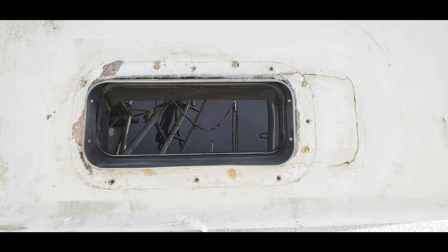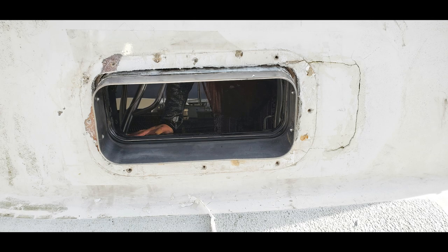Based on the pictures taken from outside, it looks good — it's sitting in the cutout the way we want it. We're going to start locating these holes and getting this thing mounted. This port light cutout looks pretty bad, actually — it looks like at the factory they mislocated the hole or cut it too big and tried to glue the piece back. On the inside we strengthened it with fiberglass cloth, and on the outside we'll use the Dremel tool to cut out that cracked piece, put in thickened epoxy, fair it in, and eventually put gel coat over it.